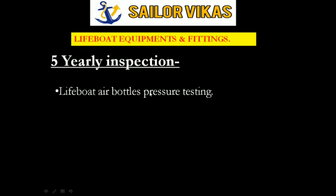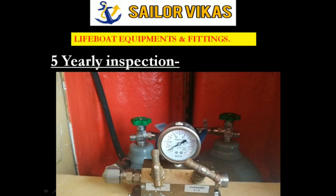Since the lifeboat air bottle is a fitting which is there in the lifeboat, it comes under 5 yearly inspection, the pressure testing. So make sure that whenever you do the pressure testing of the lifeboat air bottles, all the valves which are there, the charging valve, the exhaust valve, are also pressure tested, because sometimes you will see that these charging valves or exhaust valves leak. So always make sure that when you give it for pressure testing, or when you land it, they pressure test these connections also. So this is very important. So this was all about 5 yearly inspection.